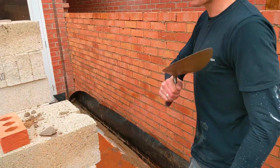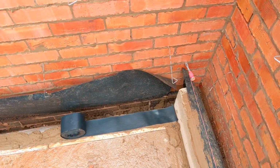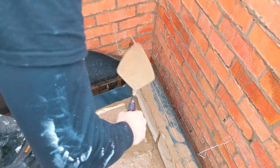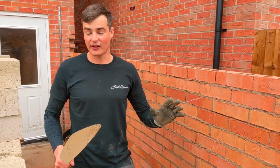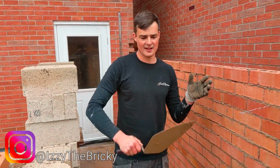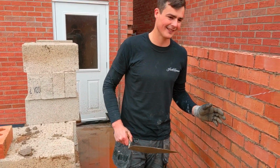What we're doing is just going around putting the first course on everywhere, bedding my 100mm tray on, then I'm bedding my DPC upstand, so everywhere's going off slightly, so then when I come to blast it up to 9 high, it's not all over the place, because these concrete blocks are a bit nasty to lay.